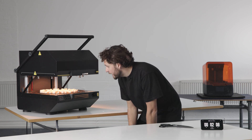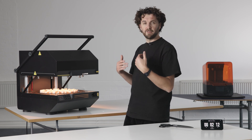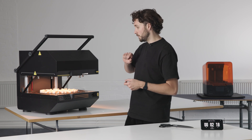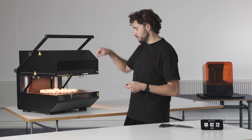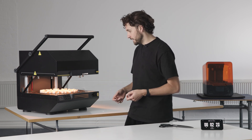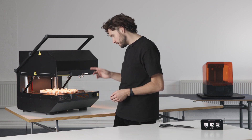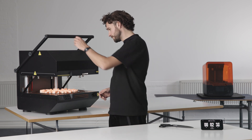We're on 135. In a second, we're going to start to see the heaters start to flicker. That's a good visual indication for us that this is almost ready to form. There's also a little beep sound, which we're going to hear in a second, that will tell us to bring the machine down, lock it off and release all of that air into the chamber. The heaters have started to flicker and we should hear a beep any second — and that's the beep.